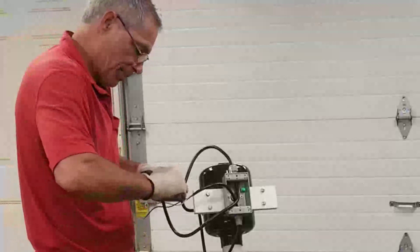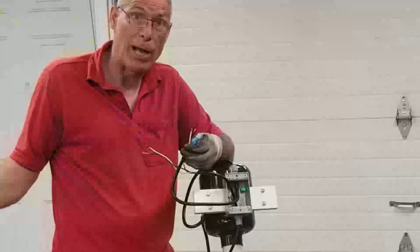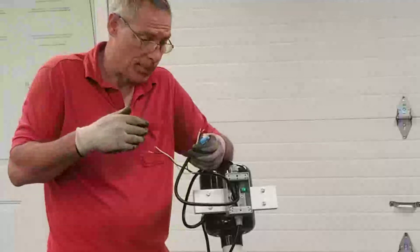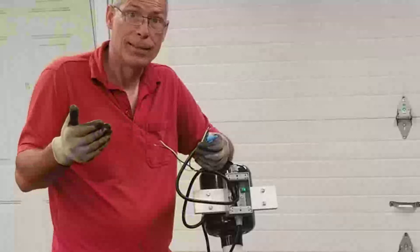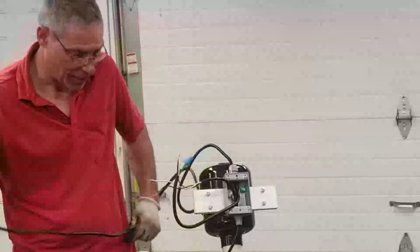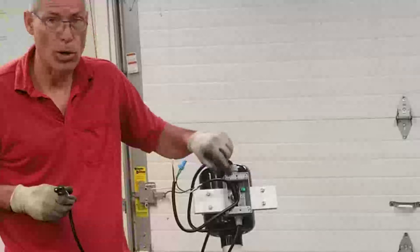Use your own judgment on that, because a lot of people will say you must ground the switch to the box. But if the box isn't grounded to the building or anything else, it becomes redundant. If the box isn't physically grounded anyway, it's not going to matter, because the ground is going to move from here directly through to here and into the building. Since this isn't connected to the building, I'm not going to do that.